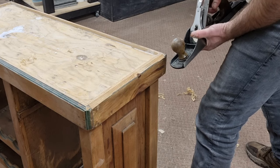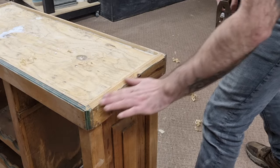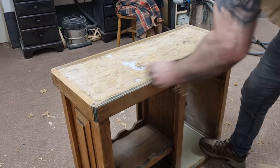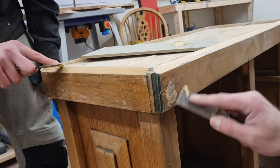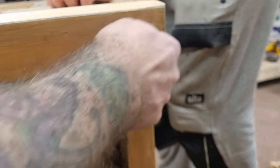The unit had an old-fashioned moulding on the edges, most of which failed to line up with its corresponding joint, so I removed these by adding a chamfer with my heavy plane. I filled any nail heads with wood filler, ready for sanding and painting later.